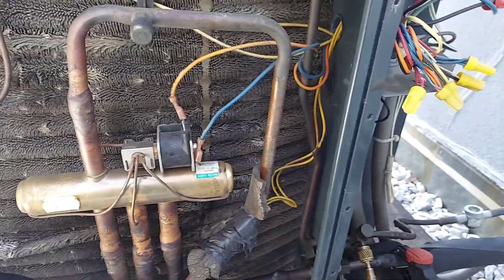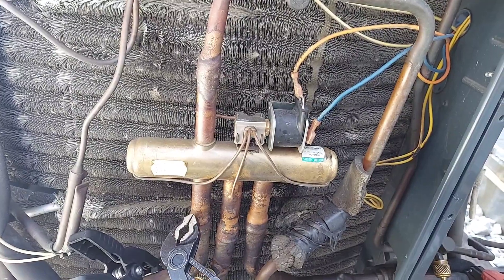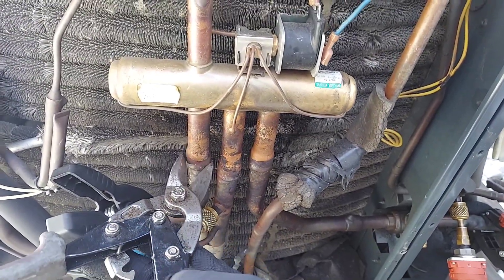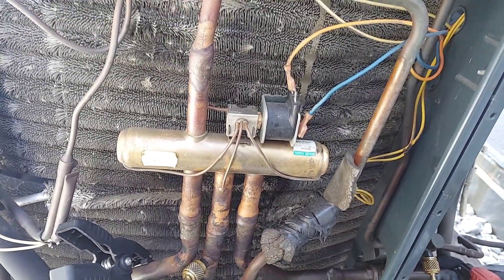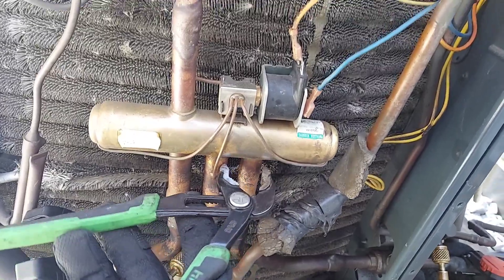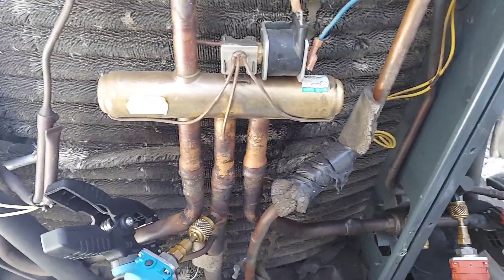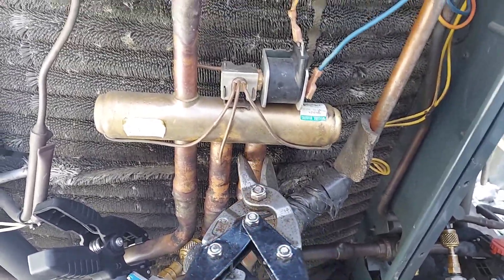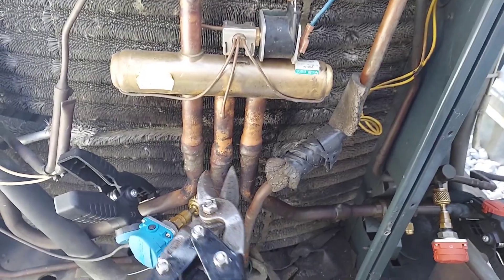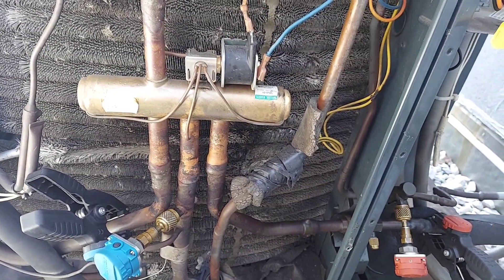Now in the event of a larger valve where the pipes are bigger — like one inch or maybe seven-eighths — obviously the snip won't be able to go around it, it's too big. So you do the same steps explained previously, and then just take a channel lock pliers, go in between, and squeeze it — make it flat enough, or skinny enough, so that your snips can now fit over it and cut right through. Once you cut all three off nice and clean, you can just unsweat them one by one. No hassle, easy as pie.